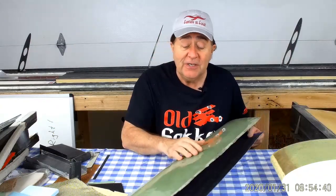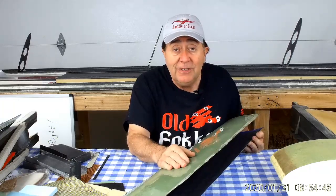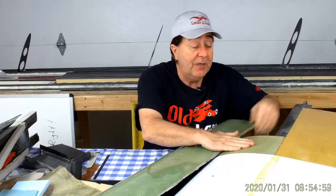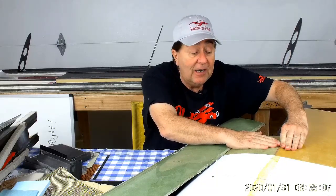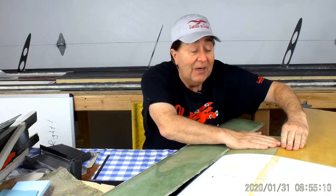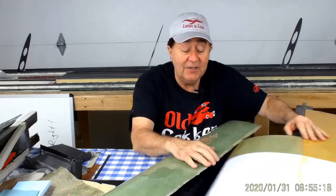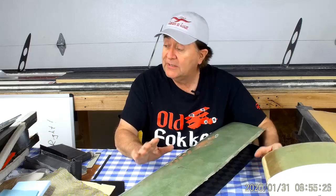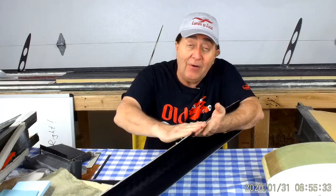His question was: when you mold these things and trim them to shape, you cut the edge off — and then you don't do anything to seal that edge. You leave that edge open. On this panel sample, the D-tube has been trimmed off to fit, comes up on the spar, glues on, and the rear skins just butt together. That's generally considered a big no-no — how do you carry the loads in the outer skin, and is that unsealed edge just going to open up under load?